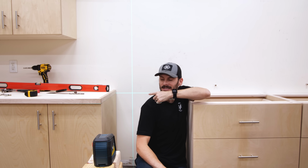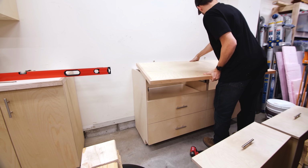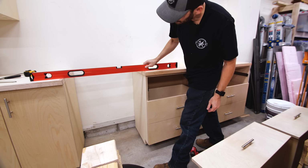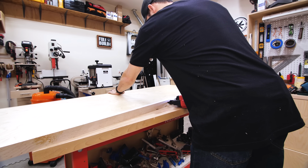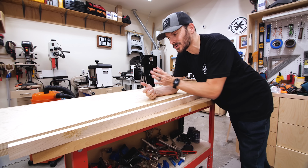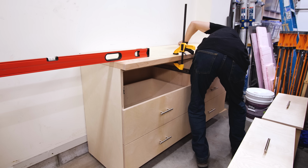So to level the two cabinets across the span, first of all, I got a little green laser line set up. I'm gonna get the cabinet leveled to where the bottom is. Then I'll put the top on and I'll use a straight edge or my 4-foot level to really span across and make sure that these are in the same plane, because that's really important. I'm adding a piece of maple trim to the back of the original top, and that's because I made the other top an inch deeper just to give me a little bit more room for the infeed, which you'll see probably in the next video when I mount the miter saw.